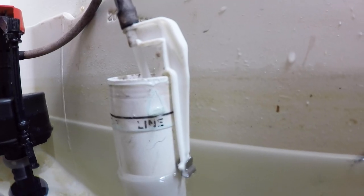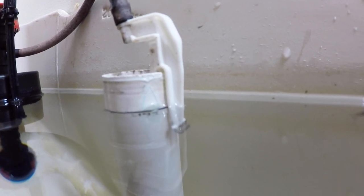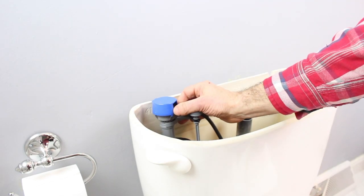I also adjusted the water level in this tank so that it would be at the mark on the overflow pipe of the old flush valve. This little kit is a really good problem solver if your leak is between the flapper and the flush valve, and in particular if the flush valve is a little uneven and you don't want to swap that out. They're available online and in many home stores. We'll also put a link to our fill valve tutorial, which goes into detail on how to swap out the fill valve if that continues to run and looks old. Make sure you check out that video as well. Thanks for watching and we'll see you in the next tutorial.